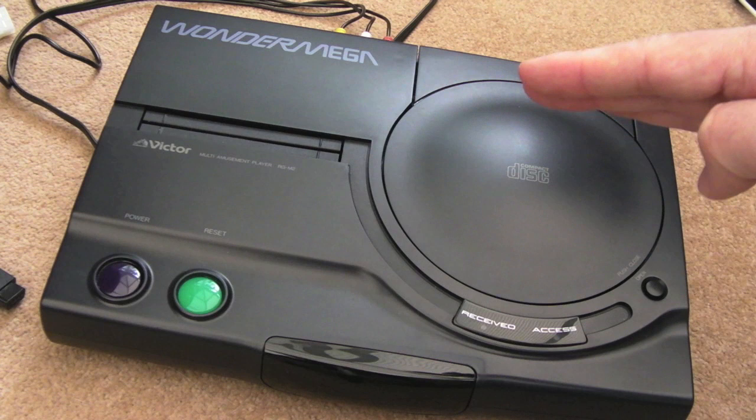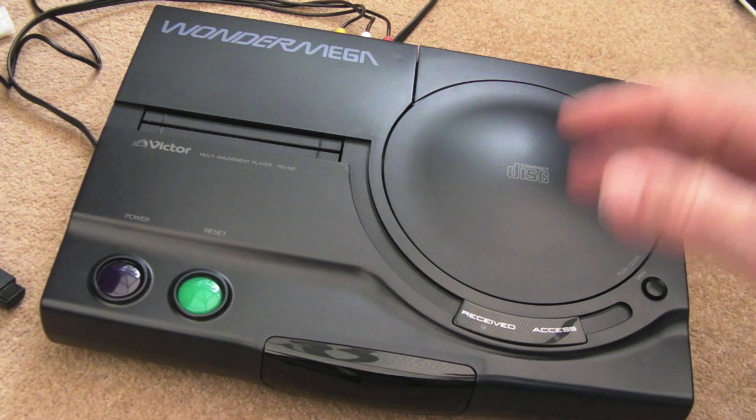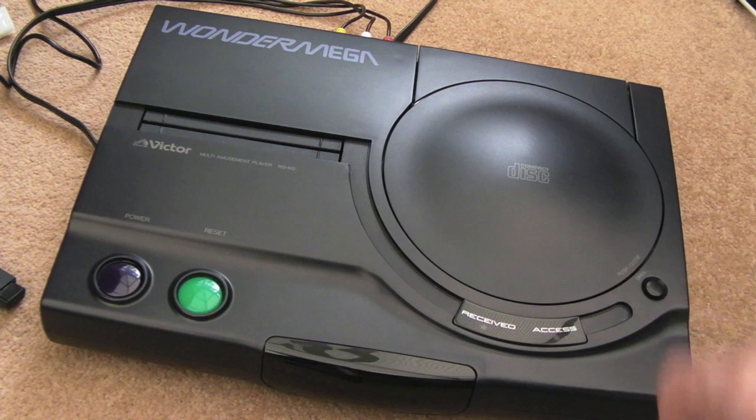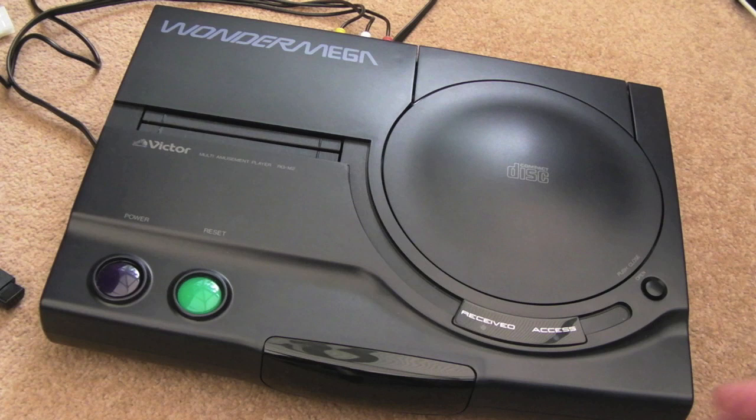The main issue is the CD audio — it was not working very well. She could increase the volume level on the TV or amplifier and just about hear the CD audio over the normal audio. The CD audio was at a very, very low level as if there was some sort of problem. I was theorising perhaps there's a missing voltage to the op-amps in the audio section. There's an audio DAC — the fact she could hear audio suggests the DAC is probably okay — and it's probably the op-amp stage after that. I did have a quick look at the JVC schematics, which should be very similar if not identical to this.